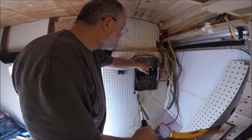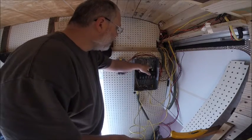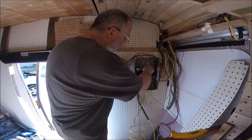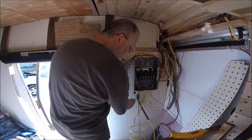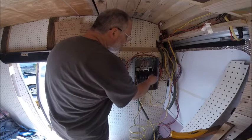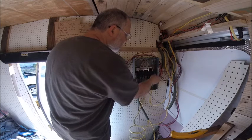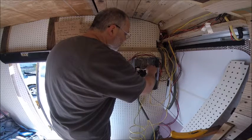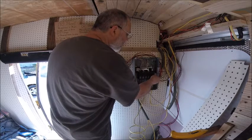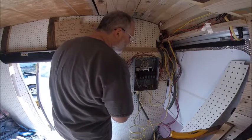Since these two here are going to go to one circuit, I've moved them around and wired them together because the outlet on the side and the outlet underneath will not be used at the same time, so that should be all right. That leaves my last circuit available for my outlet that will be going to my charging station for my Ryobi cordless equipment.